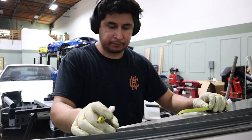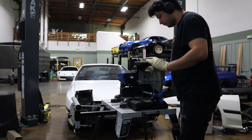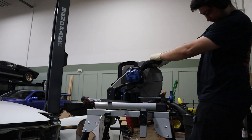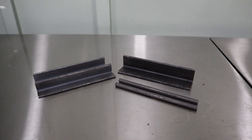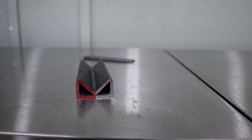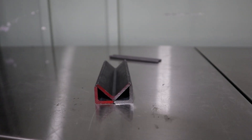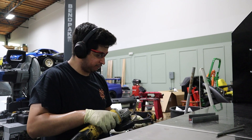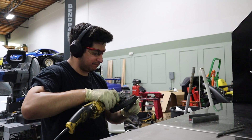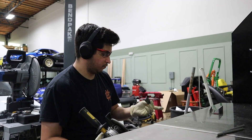Starting out by marking up my angle iron — just cheap angle iron from Home Depot — and putting it into the cold cut saw to get it all cut down to size. I've got my gate set so I can only cut it at the right length every single time. These are all the finished pieces that are going to be put together to become my press brake. That'll give me the base to press into so the metal can bend to whatever angle I want. Cleaning up all the edges with an angle grinder and a flap disc before welding.